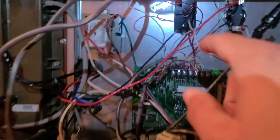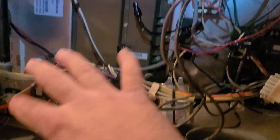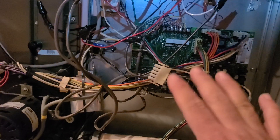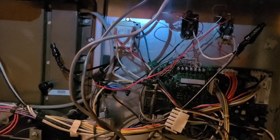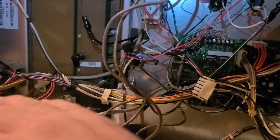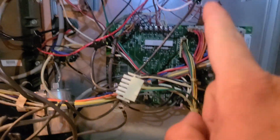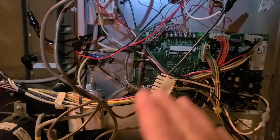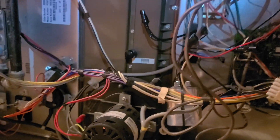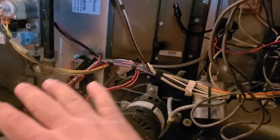If you were to replace this blower motor with a PSC and just two relays, what happens is you tie it in with your call for heat. The unit turns on, starts to heat, the blower comes on instantly. And the second the furnace turns off, the blower shuts off too, because two basic relays don't have timers in them. The unit gets real hot, and if you're running at night, the unit will turn on, off, on, off — it'll start to short cycle and trip the limit switch. The board will say the blower is bad, lock the unit out, and it won't work all night until you reset it at the breaker.